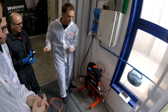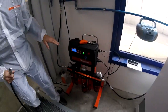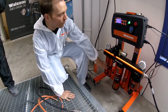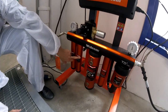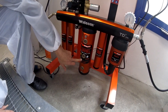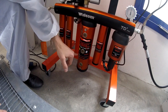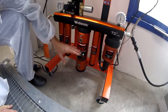So this is how the TD3 works. The reason why we can have that big impact on the quality of the compressed air is because we have four filtration stages: a water filter, an oil filter, silica gels for any relative humidity — where you can actually control the status of the silica gel from the changing of the color. When it's yellow, it means it's working. Then silica acts like a sponge, absorbs humidity, and turns blue as it goes to saturation.